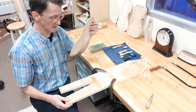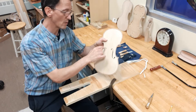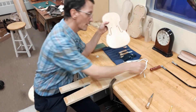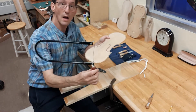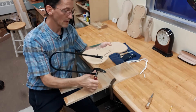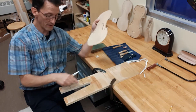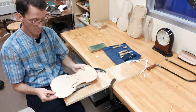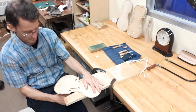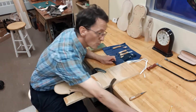For those of you who are interested and don't know much about this, the process first is to cut out the holes of the upper eyes and the lower eyes, and then to insert a saw with a very fine blade through the hole and saw the outline. Then, on what we call a V board that supports the plate, we put the plate on here and finish the cutting through the hole with a couple of single bevel knives.